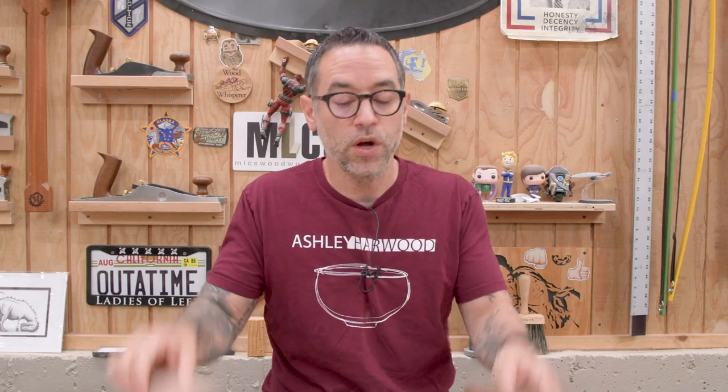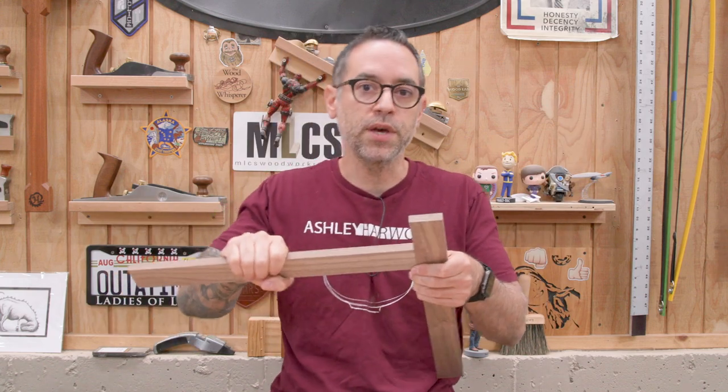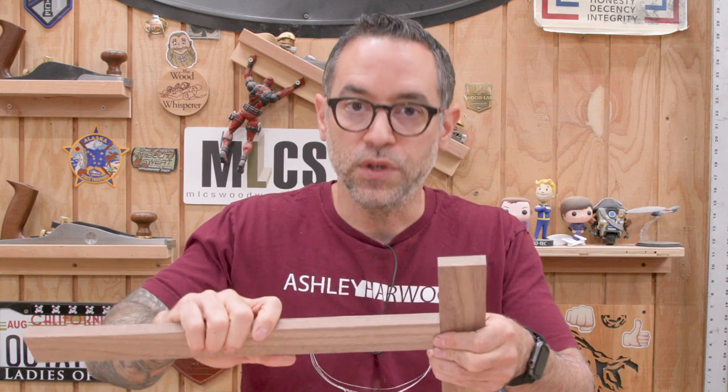I have faith that their numbers are very accurate. Fine Woodworking used a control — a simple butt joint — rated at 473 pounds to break it. Keep in mind the testing mechanism and break method are a bit different, so that number is slightly higher than Patrick's results. Fine Woodworking did this article in 2009, so why didn't woodworkers lose their mind at that time? Because that was one of the weakest things you can do for joinery — just glue alone. Woodworkers were focused on things much higher than that, and were not exactly phased by a 473-pound break.